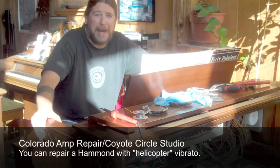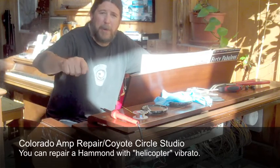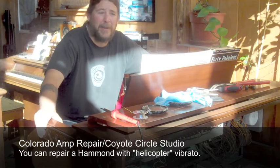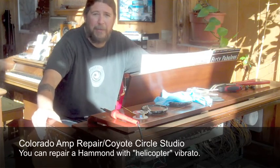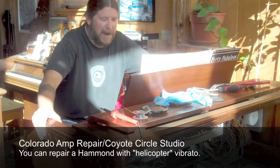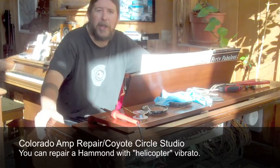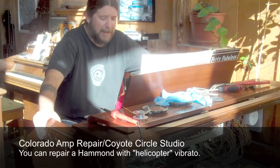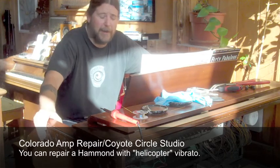I don't know if everyone knows, but Hammond organs are run by an oiling mechanism where you drip a very light oil through a series of sponges and strings that wick down into metallic, semi-porous bearings. After they've sat for a long time, some people think they're doing the right thing and they just oil the hell out of them. It ends up being quite harmful, which is what we had going on here.